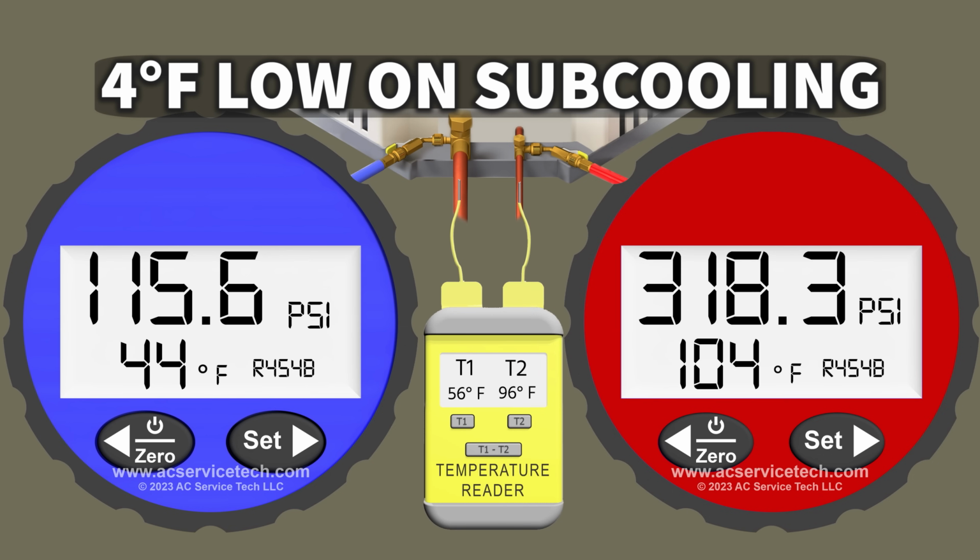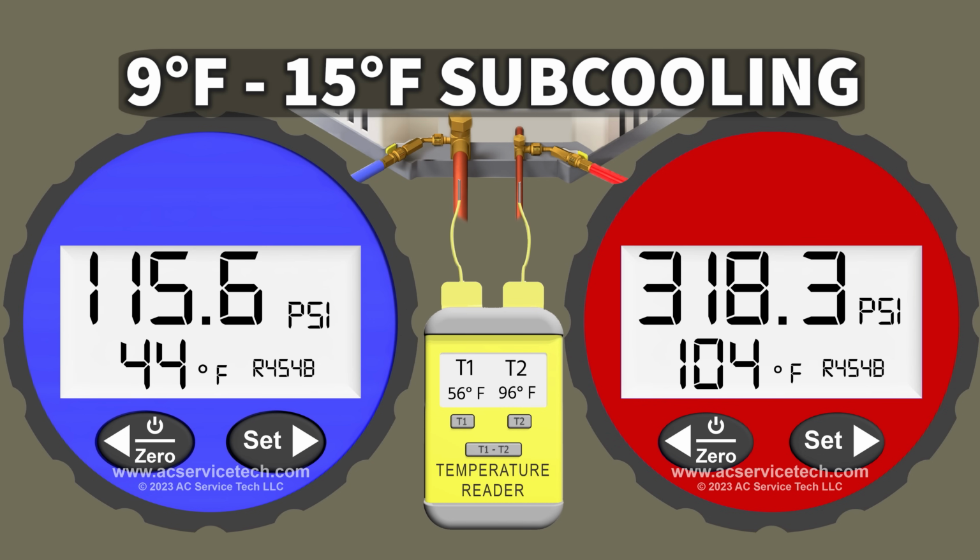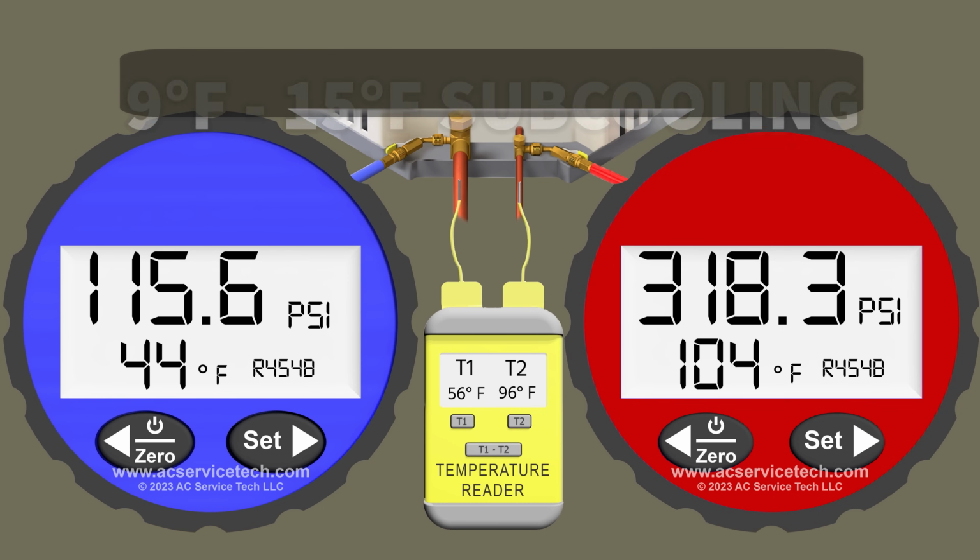So remember that we want to get about 3 degrees within what the target subcooling is. So anywhere from, say, 9 degrees to 15 degrees of subcooling. Obviously you want to get as close as possible. That's going to give you an accurate refrigerant charge.